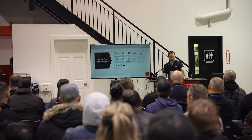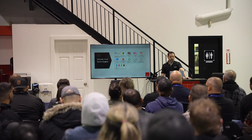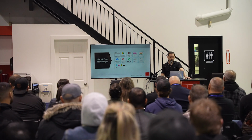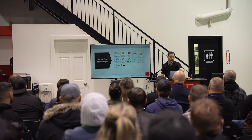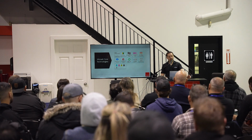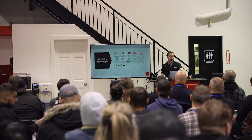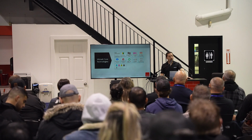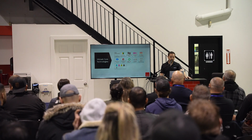Okay, so all of our TxF machines have the Mimaki core technologies: the 1440 DPI resolution, the staggered dual print heads on the 2 models, our variable dot technology, and the heated platens. We've got a nozzle dropout detection and a nozzle recovery function, which is really important. It's one of our key techs. Basically, we have a technology that can automatically recover nozzles. So if you've got permanent missing nozzles, years down the line, you can turn this feature on, and it'll use other nozzles to print for those missing nozzles, up to 10 nozzles per line.